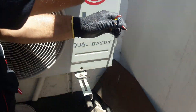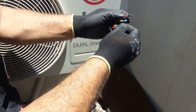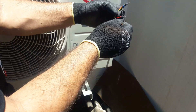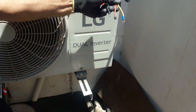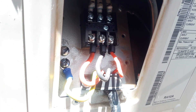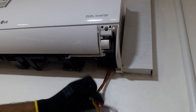It is very hot outside and there is an outdoor unit running next to me — it blows so much hot air. I really need to finish this and leave. I connected the wires. Let me show you how they should be connected. There are four wires: the green with yellow strip is the ground wire, the red wire at 2.5 millimeters is the constant circuit, the black wire is neutral at 2.5 millimeters as well, and the last wire is the control wire at 1.5 millimeters. Now we're going to connect the wires to the indoor unit.